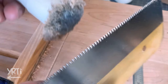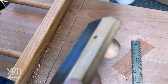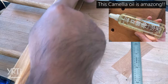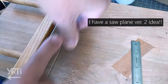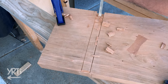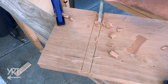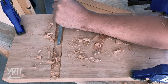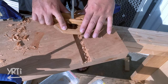Now is the sliding dovetail. I'm using the jig I made. With good blade lubrication, I can somehow manage to cut the outlines of the sliding dovetail. But I still don't like the friction that the saw plane makes when going across the grain — I think I have to improve the saw plane. Then I cleaned the bottom of the mortises by chisel and router plane. By the way, the dovetail was deeper than the saw plane blade, so I cut only about half of the dovetail depth, then cut it all the way with a saw using the saw kerf as a reference.